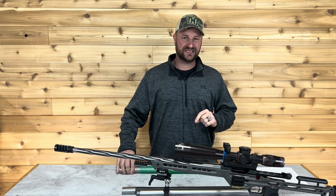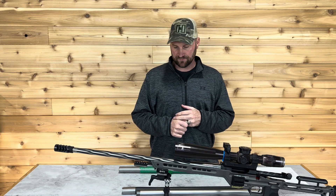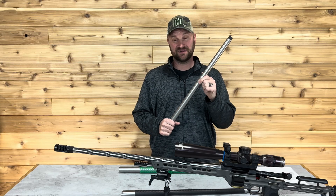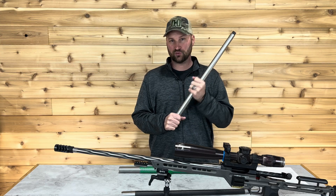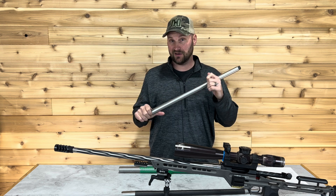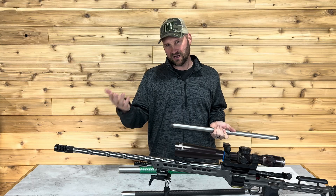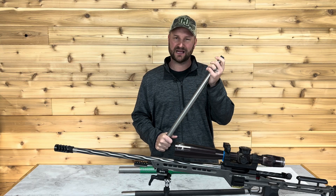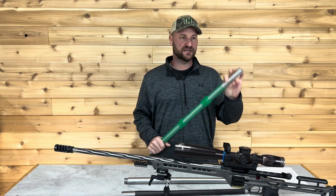The first thing is obviously stiffness of the contour and the barrel. The thicker that barrel is, the more stiff it's going to be. Obviously you have more metal around the bore to really support it in a stiff way. Typically accuracy comes with stiffness as well, so you're going to have a nice accurate barrel when you go with something that's a very heavy-duty stiff barrel.